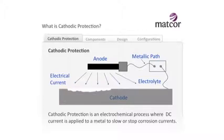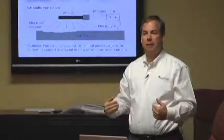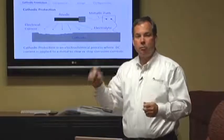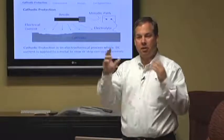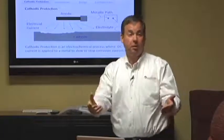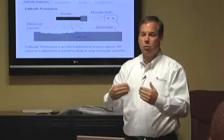Question: if this was the wall of a pipe and the corrosion is on the outside, does cathodic protection protect the inside of the pipe? The answer is no. Cathodic protection only works by putting current onto the surface of the structure. I can't put current on the inside of the pipe unless I have the anode in the pipe - and we actually have a product for that, for certain applications where anodes inside the pipe throw current to protect from internal corrosion.